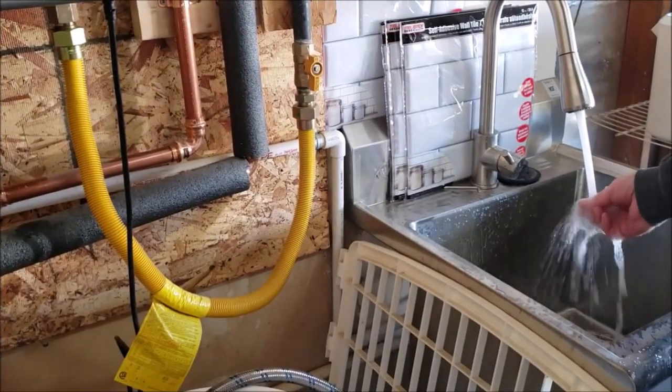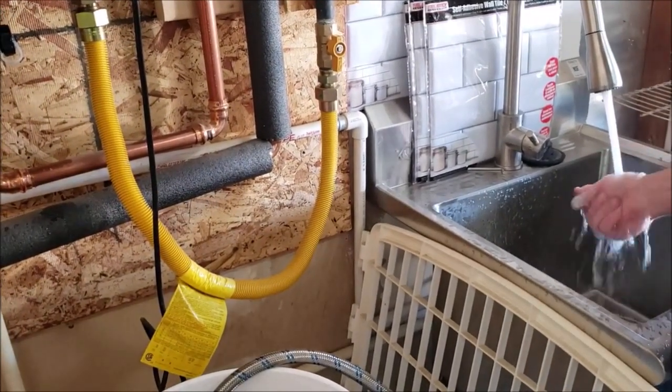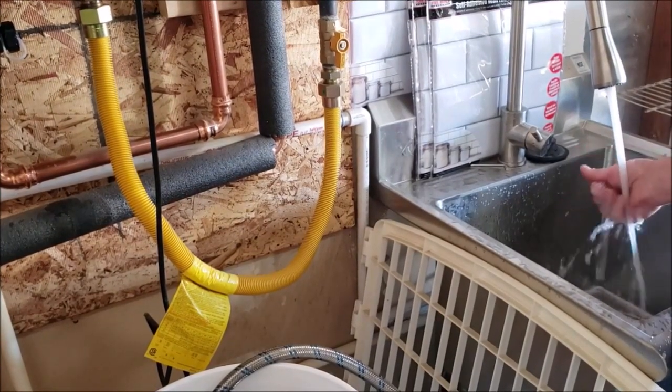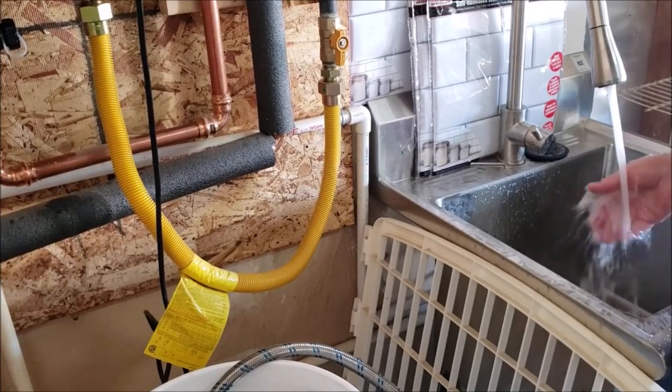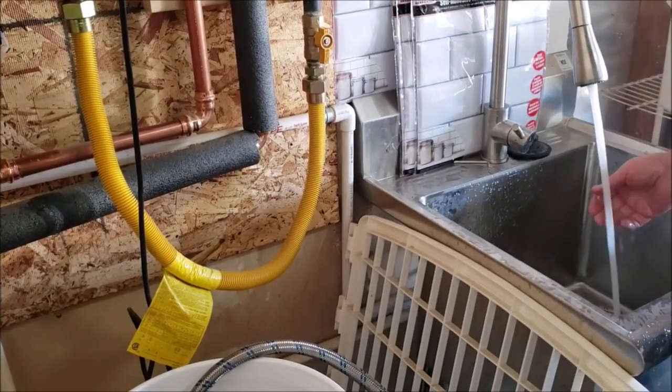You don't need to, I mean, if you feel like you can turn it down some, like this right here, that's full 120, about 5 minutes in with good, healthy, thick skin, you're good. After that, you start scalding. Like I can feel that would start scalding real fast. So you can even turn this down to 115, depending on your showers.